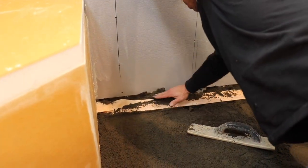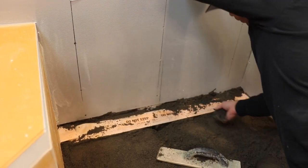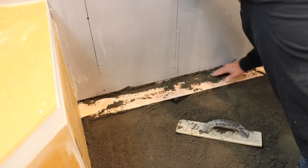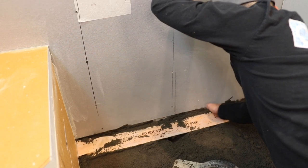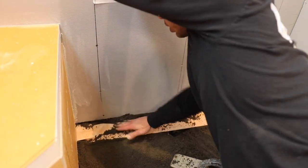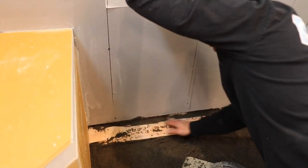I'm just packing it in there real good. It's a nice thing about working with deck mud - I've said it time and time again how much easier this is to work with than brick mortar. It's like building a sand castle, it's not messy, it goes where you want it to go. It's a four or five to one mix - five parts sand, one part cement, and just a little bit of water. It doesn't have a whole lot of water to it.